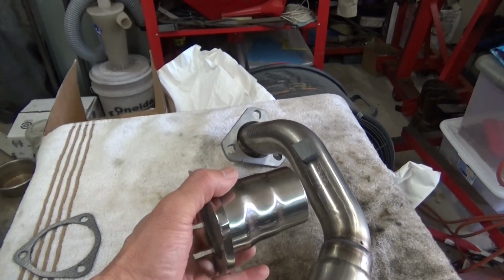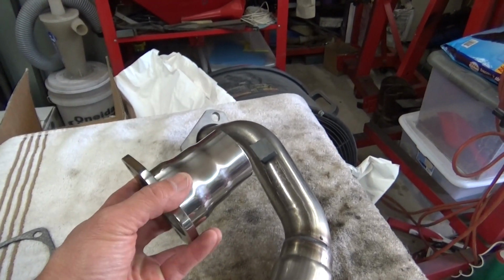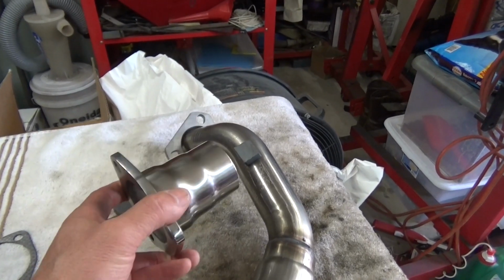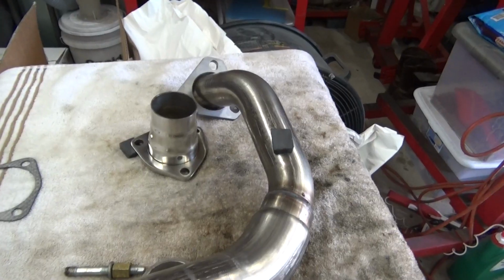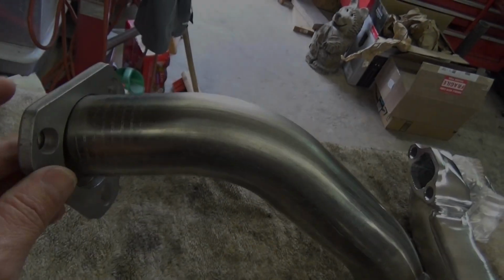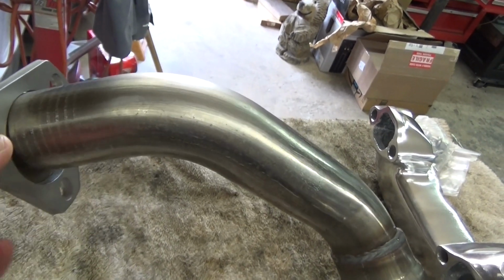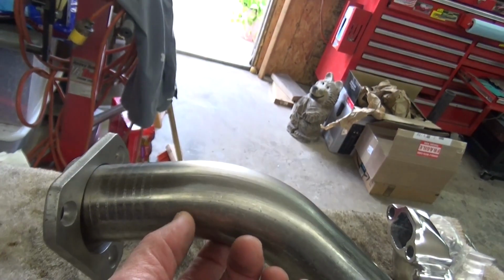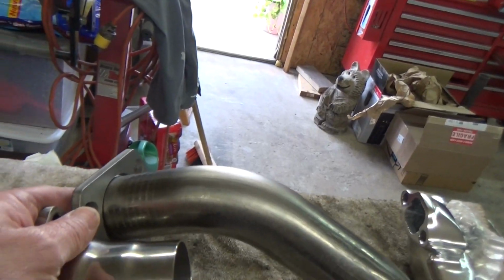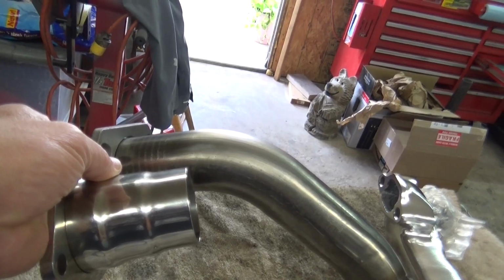So all I've got is 75-25 gas, 75 argon and 25 CO2. That's what I've got on that bottle. Anyways, that's where I'm at on that. I'm gonna have to end up cutting pretty much of this off. The way that measures, I'm probably gonna have to cut right at the edge where it starts to curve, probably that much of it off, because I measured it just eyeballing it, and that's pretty much all of it right there.